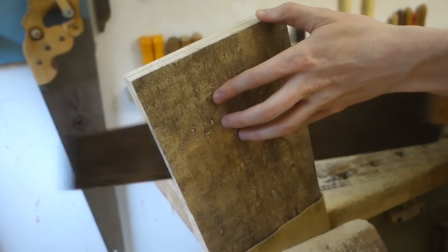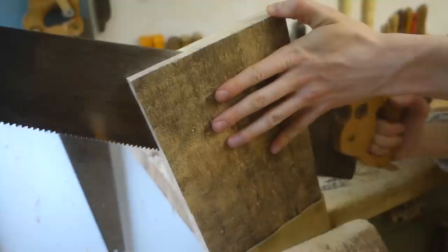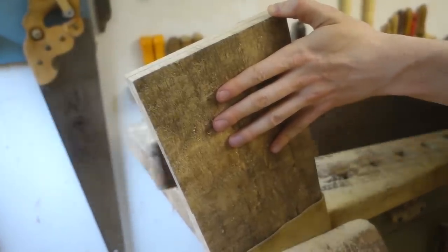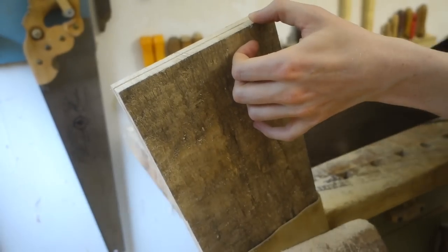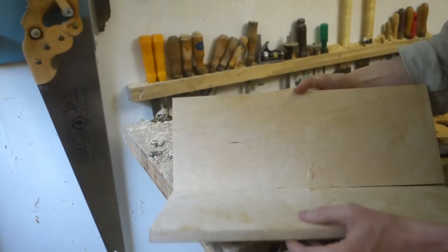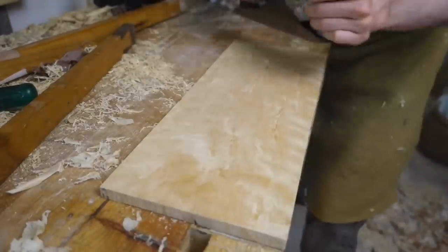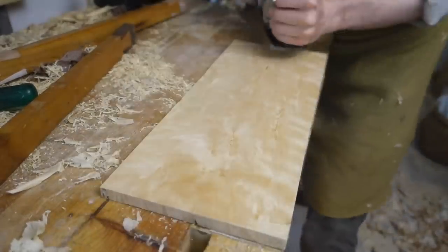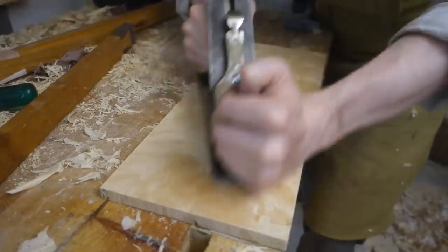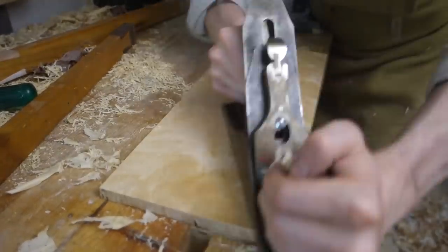And this is a thick piece, so I could resaw some more and get both front and back out of it. I feel like we don't talk enough about how much resawing there is in woodworking. Like, joinery is fun and all, but this is where the real hours are spent. Hard to argue with the results, though. I flattened these boards entirely with a smoothing plane, since I'm terrified of tearing out this wavy grain, and it kinda goes to show you really don't need several planes. A number 4 will flatten boards fine if that's what you have.